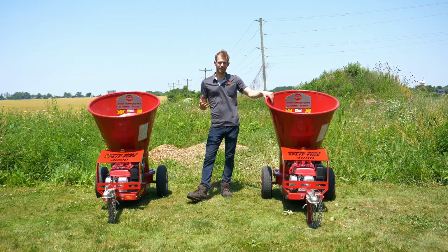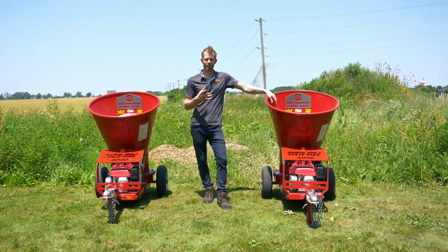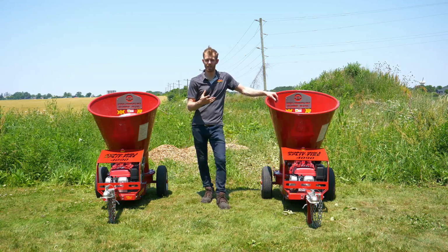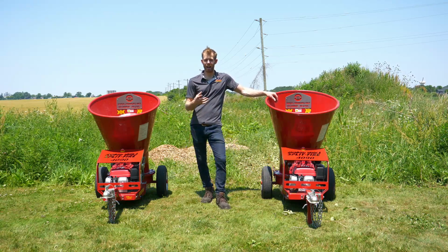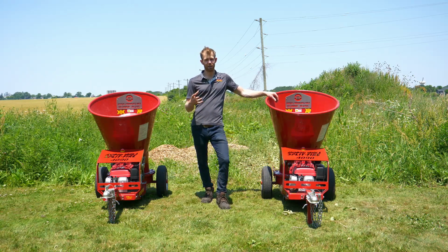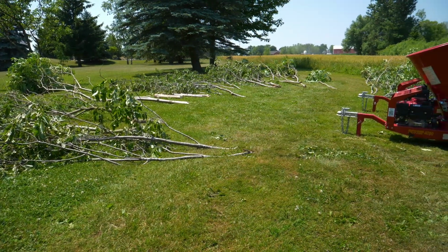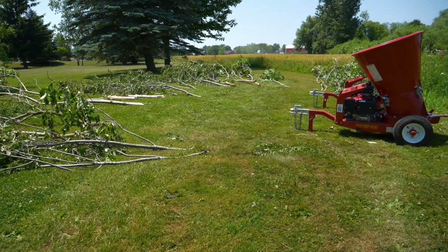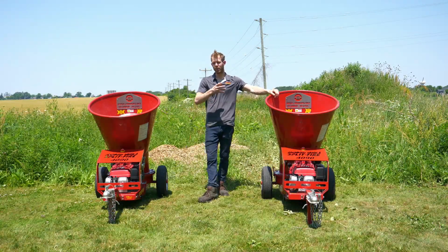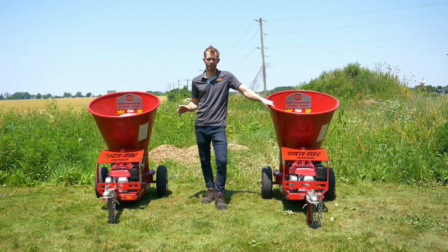Now, that being said, a two blader is fairly standard, and it's nice because when you're chipping a lot of your 1 to 2 inch stuff, which is the majority of the stuff you're going to be chipping, it's just a lot faster. Now, when you get into your bigger stuff, you'll see me in this video, I got a variety of sticks here and I'll be chipping it. You'll see me when I get into the bigger stuff, I'm going to be stopping at halfway to let the rotor regain RPM, and I'll be dumping the rest of the branch through it. With the one blade rotor, I won't need to do that.